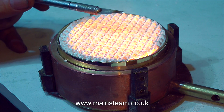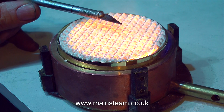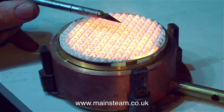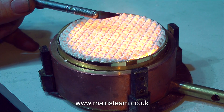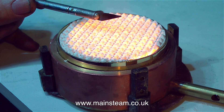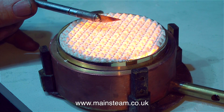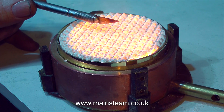I'm just testing the heat by cremating my craft knife, and it takes no time at all before the blade glows red. I'm not detecting any carbon monoxide in the workshop because I don't feel ill, I'm not going dizzy and I haven't died. I know I'm being flippant about carbon monoxide — it's very nasty stuff. So by way of a quick health and safety warning, it's a good idea to get a carbon monoxide detector in your workshop if you're messing about with gas burners.